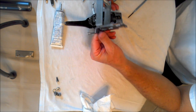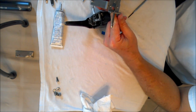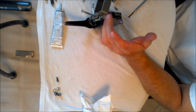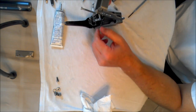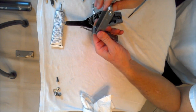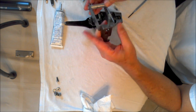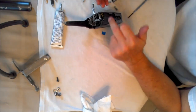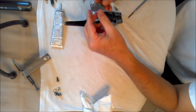You can get all these parts over at Ace Hardware. This is just some 1/8 angle iron, steel rod, just some angle 1/8 steel, and then I just bent these, turned this on my lathe, and then drilled and tapped for the threads. So that was pretty straightforward. Originally, what I did to take this out of here was I made this.